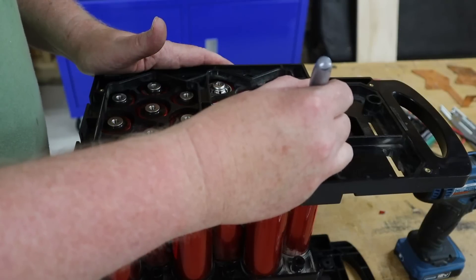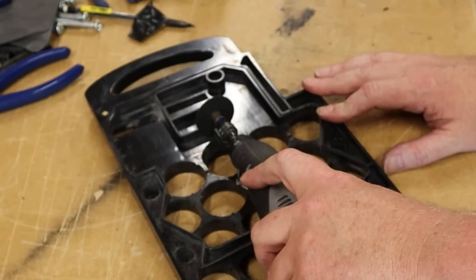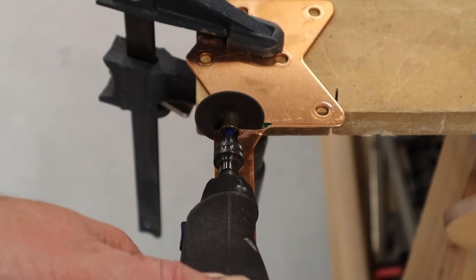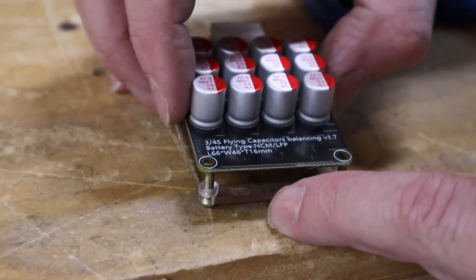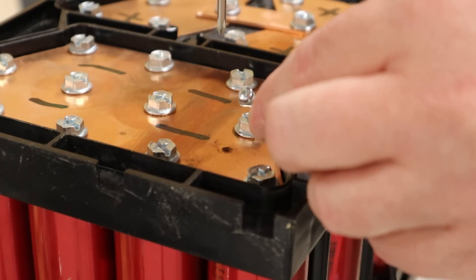But you're not done yet. You need to make a jumper to connect the positive terminals. To do that, this plastic divider has to go, so I'm going to hack it off with my Dremel. The same thing goes for the dog ears on the copper bus bars — that piece is going to need a few holes in it because it's going to be used as a jumper to connect the positive terminals. The next step is to install either a BMS or an active balancer. I'm going to go the balancer route, and I ordered one with a tiny little acrylic case — as always, there's a link to all this stuff down in the description. This is a 4S bank, so I need a 4S balancer.